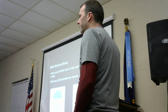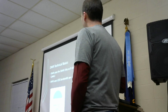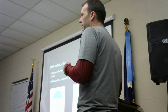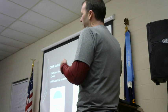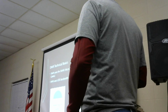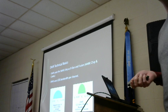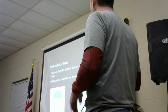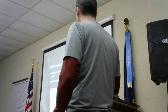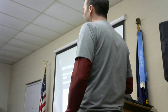That was a hard thing for me to grasp when I first started dealing with time slots in DMR. If you're on the same repeater, you have to be on the same time slot and the same talk group. But if you're on the same talk group on a different repeater, you can be on a different time slot. It doesn't matter. DMR uses the same codec chip as D-Star and Fusion, which I always thought was interesting, but it uses less bandwidth. Your ham stuff is generally wideband, 25 kilohertz channel spacing, 5 kilohertz deviation. DMR is 6.25 kilohertz, with 12.5 bandwidth for the whole channel. When you have two time slots in there, 6.25 each, you split that in half. So it already meets the FCC's next mandate for narrowbanding, which they haven't announced a date for yet. Amateur radio is exempt.